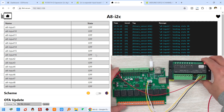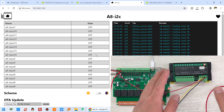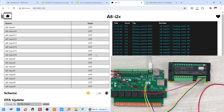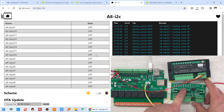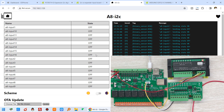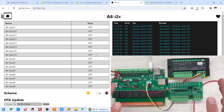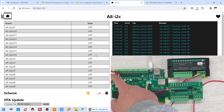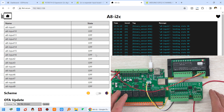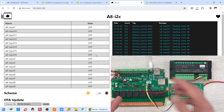This is how to add the DI8 to your Home Assistant using ESPHome, so you can easily extend the GPIO for digital input. If you want more input channels, you can add a second DI8, third, or fourth module. The PCF8574 supports a maximum of 8 addresses on one I2C bus. If you have two DI8 modules, you will have a total of 24 digital input channels for your ESP32 module. Thanks for watching.